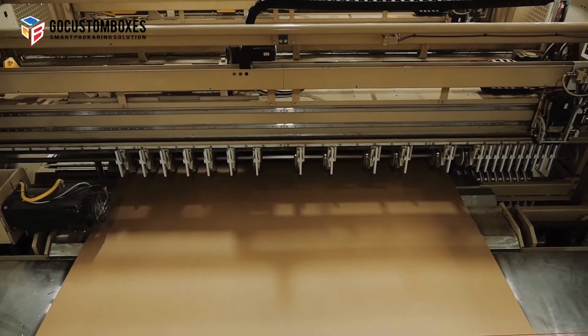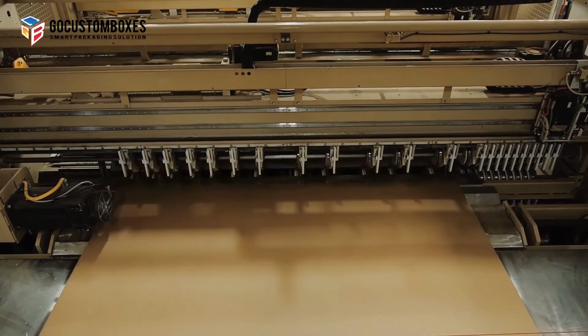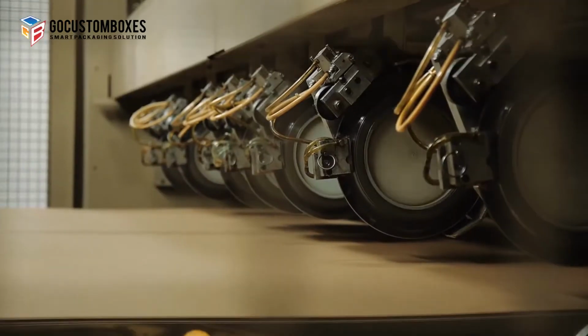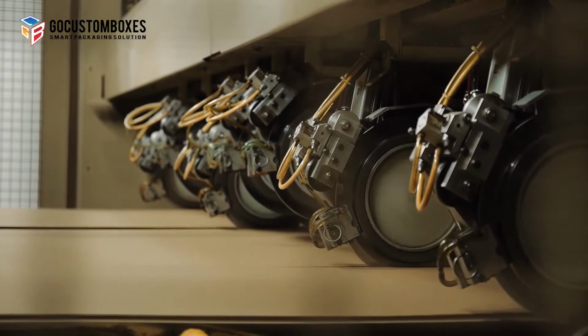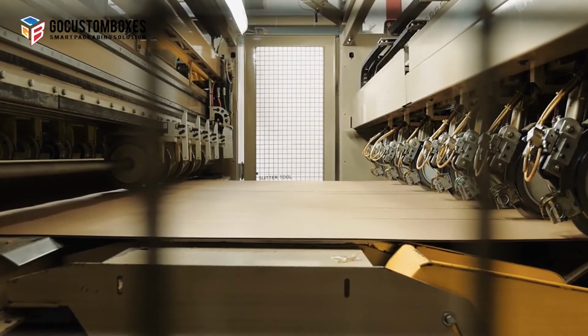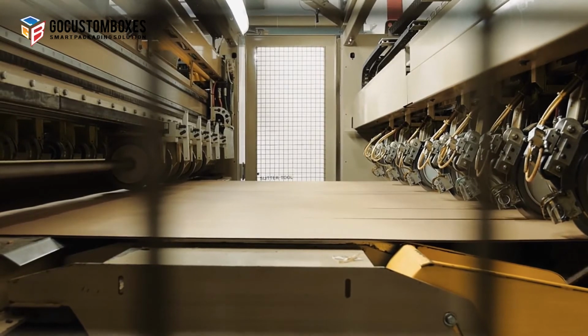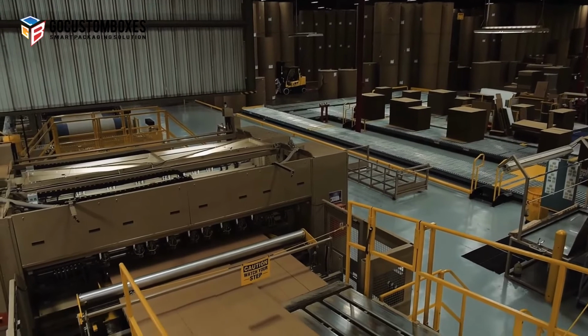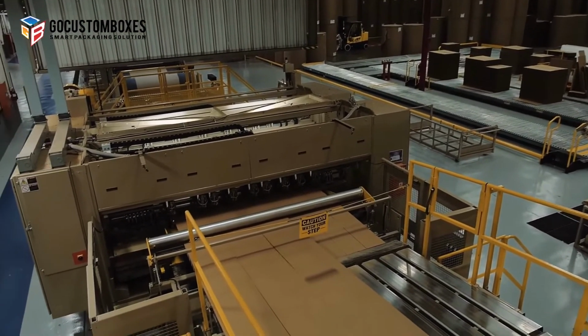When it is time to change orders, the shear severs the board to create a small gap to allow the slitter scorer sections to either drop in or rise from the board path, so the board can align between the top and bottom shafts that the scoring and slitting heads are mounted on. This feature allows order changes to occur at line speed.